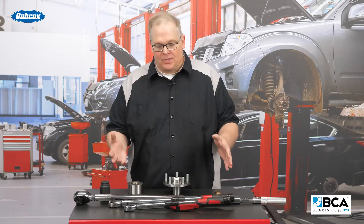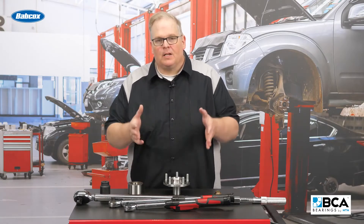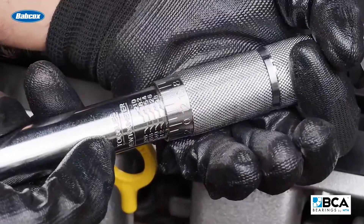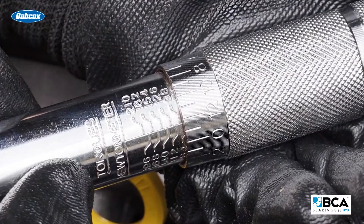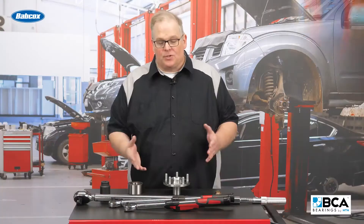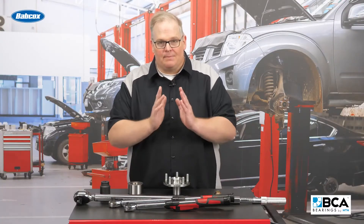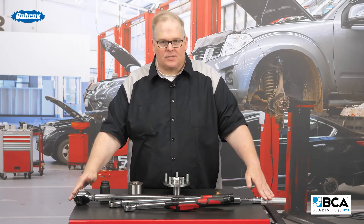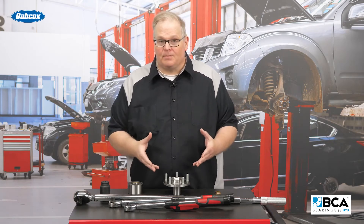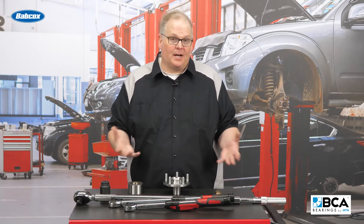With this, you need to concentrate on the torque wrenches. These torque wrenches have a range. If you looked at the range on an accuracy scale — plus or minus, let's say, three to five foot pounds — a torque wrench is going to be more accurate when it's in that middle part of its range. We have a 600 foot pound torque wrench right here, and where is this going to be the most accurate? Typically around 300 foot pounds.